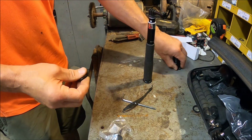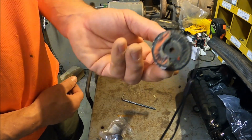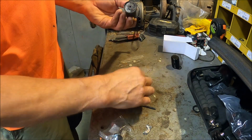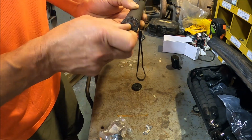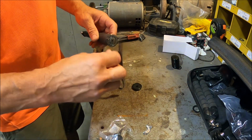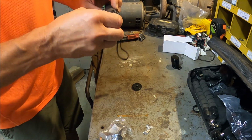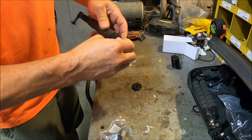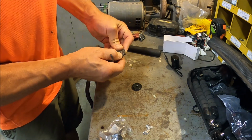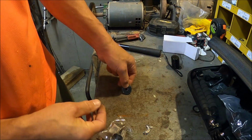So what the problem was with that was, now see, it's broken. That's the problem there. The magnet's really hard, and I had to drill it out. This is quarter thread, quarter 20, and the problem is the hole size is close. It's not quite the right size, and I wanted it flat. They countersunk it originally for a smaller bolt, so I tried to drill it countersunk. See, it has a countersink to it.